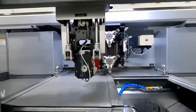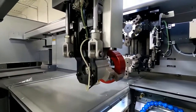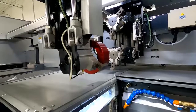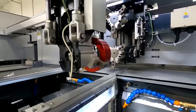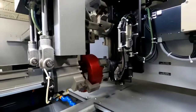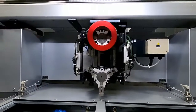Now we go to the middle station turn device. Notice — and this is a patented Takamatsu feature — we actually do a pickup and drop-off at the same time. The load hand and unload hand are in line with the turn device grippers on both hands, so we simultaneously drop off a finished op 10 part and pick up a turned part. The machine then flips the part using a very ingenious mechanism to prepare it for op 20.